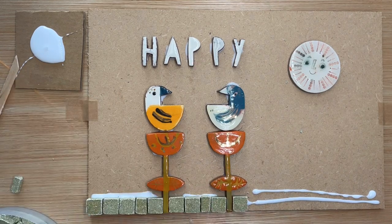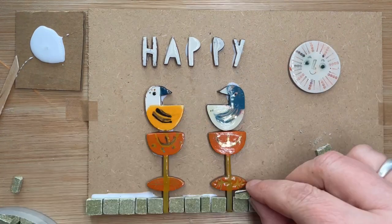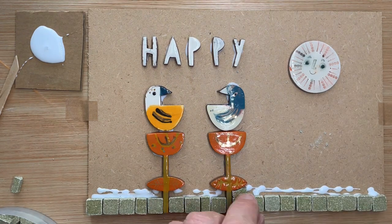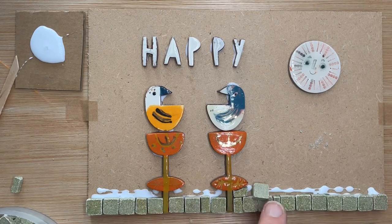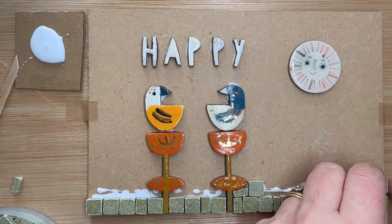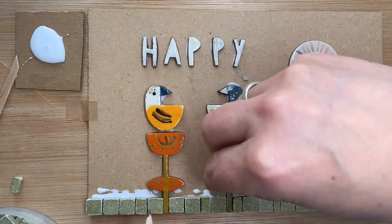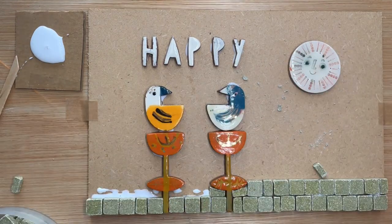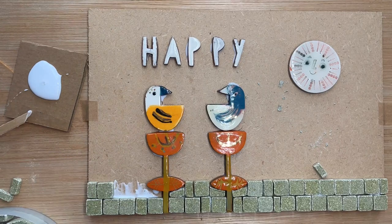When you have to cut a tile to fit the space, lay the tile over the space and mark it with a pencil and cut it to fit. It may take a few attempts to master and you will see me repeating this. Avoid tiny pieces as they attract attention, and note that every other line starts with a half tile. This sets up your offset pattern and it continues all the way up. Mark with your pencil, cut and place.